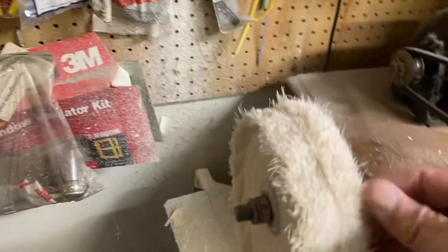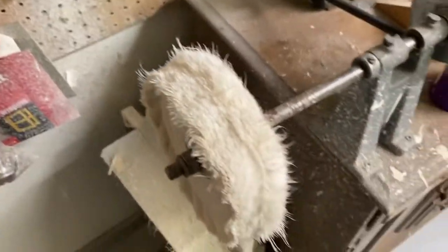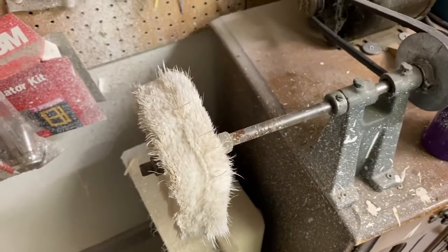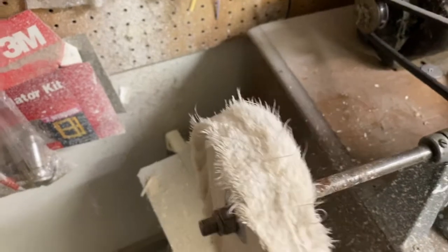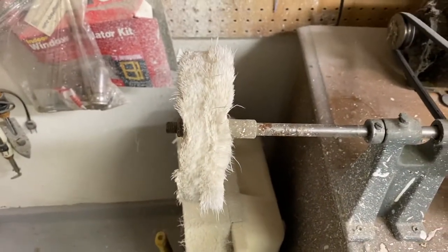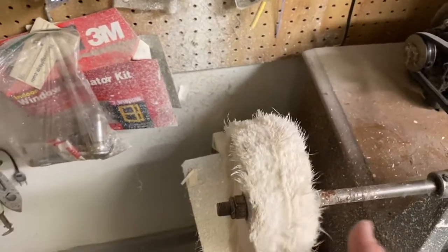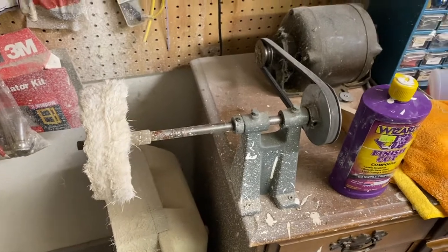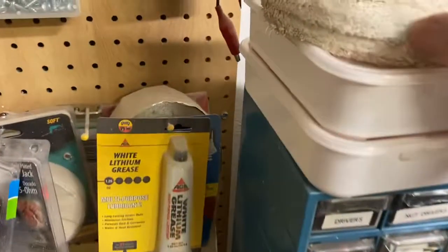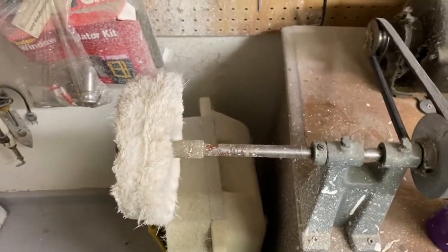This is the pad that I use. I use two of these pads that are half inch thick. That gives me a 1 inch. I tried going wider. It doesn't make it any better for what I do. I put online in a guitar finishing forum that I ran the last pads a little bit long, so when they get like this, I don't think they buff as well, so I was really super happy with how this last one buffed.